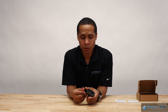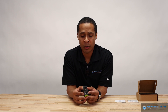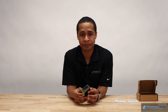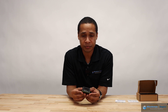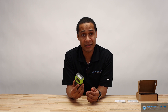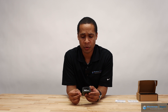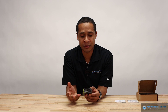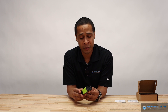From a software and tool standpoint, we are able to do barcode grading, OCR with predefined OCR codes, or if you have your own custom one, you can set up trainable OCR. OCR is optical character recognition. From the vision system standpoint, it is able to handle object location, pattern matching, presence/absence detection, metrology, and more — we'll have another video that talks about that.